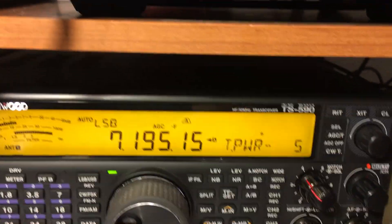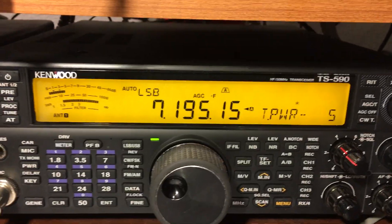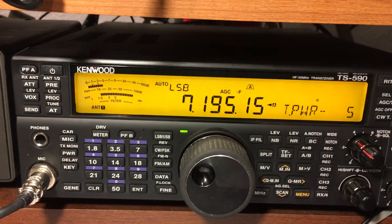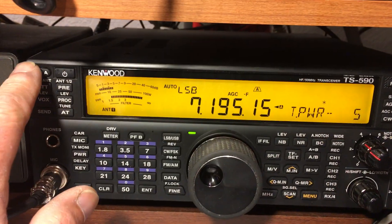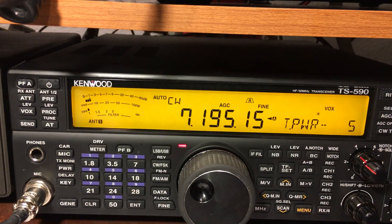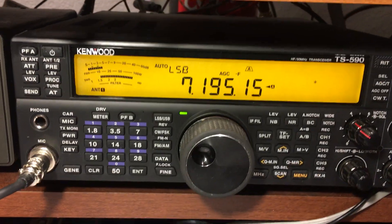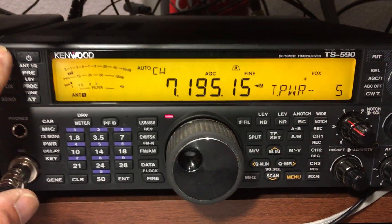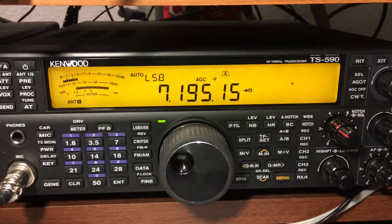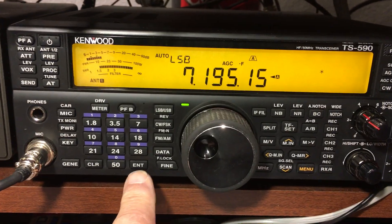Normally I leave it at 5 watts. If I am going out to an antenna and want to check the output, a 5-watt carrier is not going to interfere with too many people. If I hit this again, it transmits that 5-watt carrier. If I hit PFA again, that goes off. So I can just press it on or press it off anytime I like for a quick check, whether it's a dummy load or an antenna.